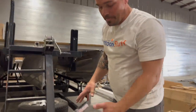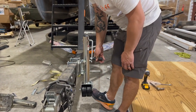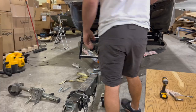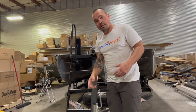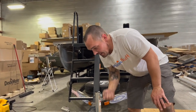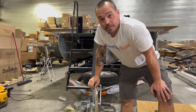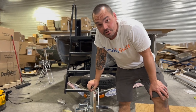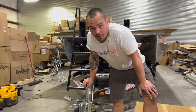We're snugged up. If you're trying to put your dolly down and you turn it but the wheel turns, you have to stop that wheel from turning in order to get the crank to engage for the jack to extend. This is a trailer for a 22-foot tri-toon, so that double wheel is going to make it a lot easier when we need to move it around by hand. Plenty strong and fast to crank up to get it on the hitch of your truck or tow vehicle. Pontoonstuff.com has these, along with all your other trailer accessories like lights. Not just a great place for your furniture and flooring, but also for your trailer too.